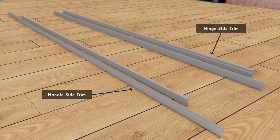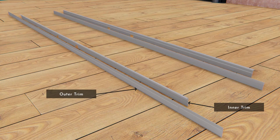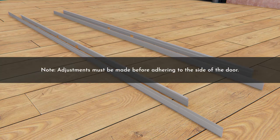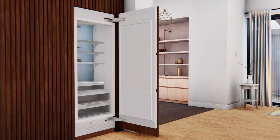There are two door trims to install on the overlay door panel: the door trim for the handle side is a long trim, and the door trim for the hinge side is a shorter trim. The side trim consists of an outer trim and an inner trim. The inner and outer trim should be adjusted vertically to align with the top and bottom hinge covers during test fit. Note that adjustments must be made before adhering to the side of the door. These trims slide in and out to hide the gap between the product door and the overlay door.